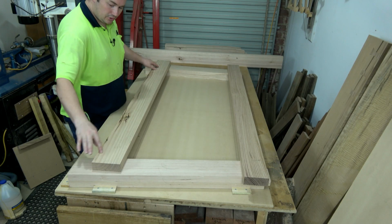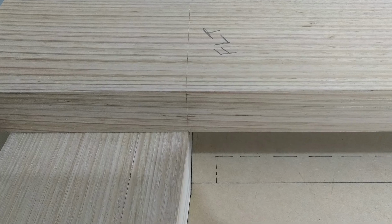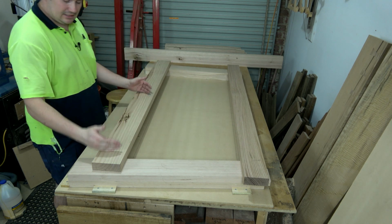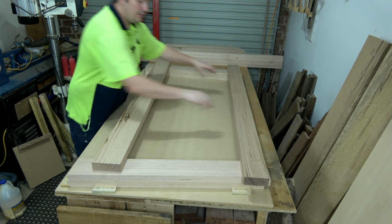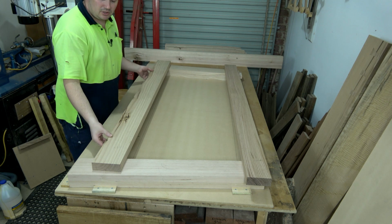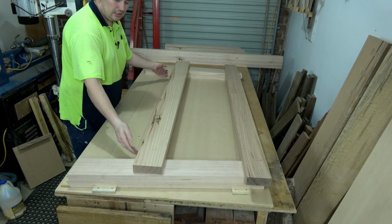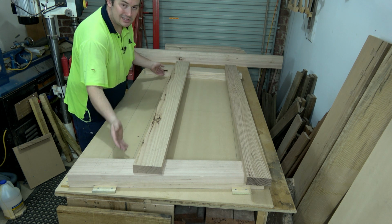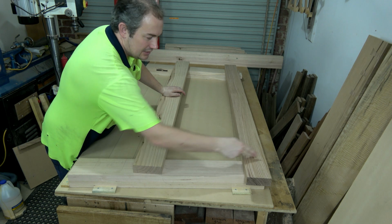So now that I've got all of my shoulder lines marked, that's the most important part. Like, that is probably the most important part of the entire job, because that distance here is that distance, providing that rail is in this location. This one can actually slide up and down that little bit because those shoulders are square or very, very close to it. But if I was to cut these at that shoulder and then push this rail up, the distance between that point here and that point there is now not the same length as that shoulder that I just cut. So those legs have had to splay right out, which then turns that leg way out on an angle, which then changes this angle over here.